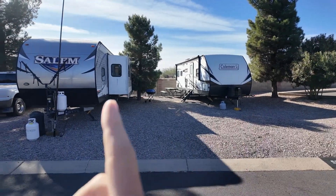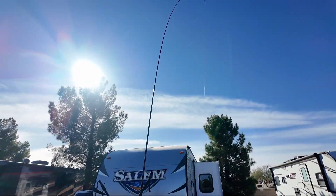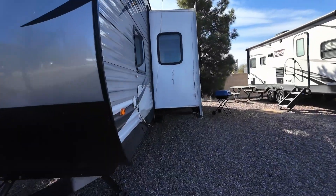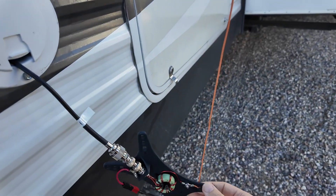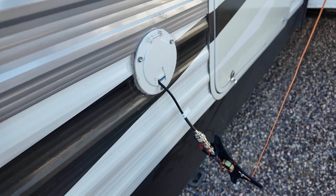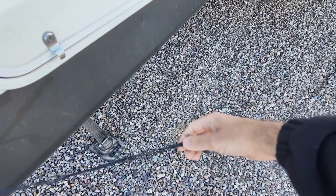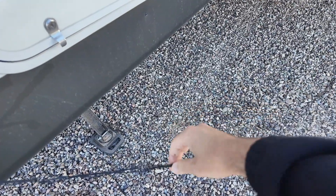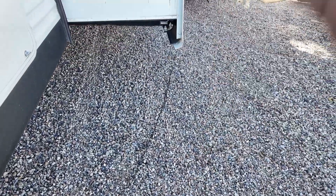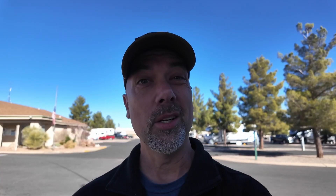I am really space compromised here. That is my nearest neighbor, that is me, and that is my next nearest neighbor — we're real close together. I don't have a whole lot of room, but I do have the mast up in the air with the antenna. It goes down to our Poseidon antenna, which is fed through the wall of the RV with a big hole I cut just for running antennas in. Because I don't have a lot of space, I only have one of my radials down — technically all four are still there, but when they're like this it's really just one big radial going off in the only direction I can have it go. That's my neighbor's grill right up next to my RV. And because my RV has all metal siding, I can't get two-meter radio signals out to local repeaters, so I've got to use an external antenna.